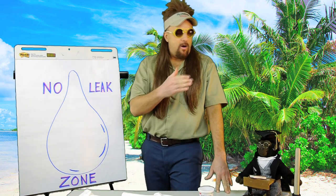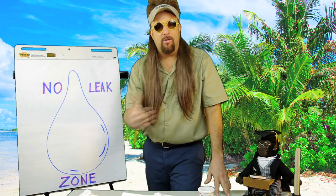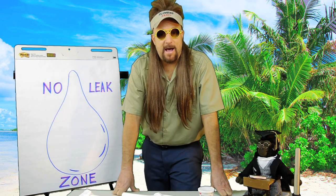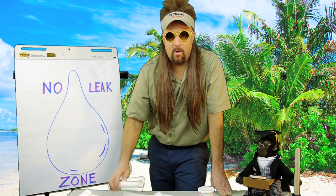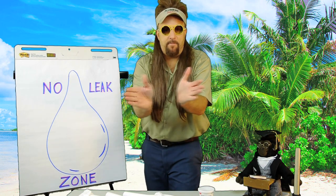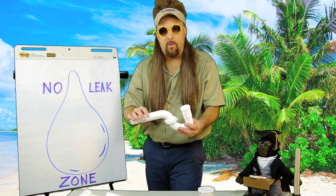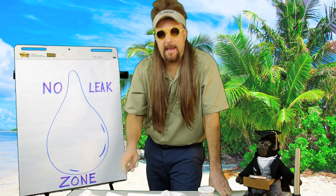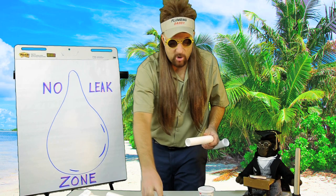Today's video is how to repair the piping underneath the sink. All that piping underneath the sink ultimately has one goal: to take the sink water and dishwasher water out of your life forever. If you have a garbage disposal, then the dishwasher drains directly into the garbage disposal. If not, it will drain into a tailpiece right here that comes down from the sink. Water that you run into the sink drains down into these tailpieces. From the tailpieces, each will occasionally go into separate P-traps. This is the P-trap right here.